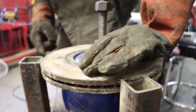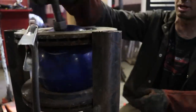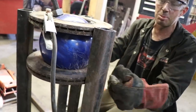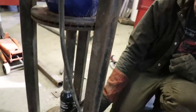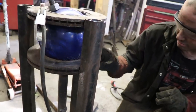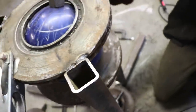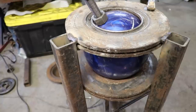This bottom rotor doesn't necessarily have to spin like this because the ball will spin on its own, but it does need to go up and down. If it gets tight you can just take your grinder and make a little flat spot and spin it so it hits the flat spot. With three legs it allows you to move one leg in or out just to give it that little bit of clearance you need. I found a little shim, shoved that in between, and I'm happy with that spacing. So now we can weld this thing solid on the bottom as well.